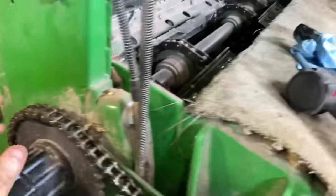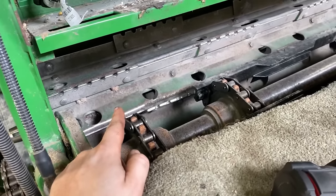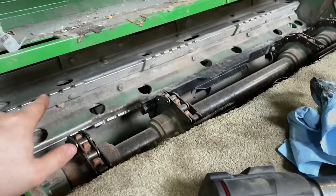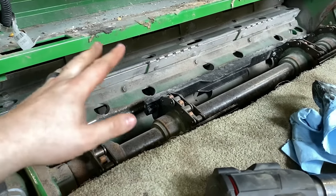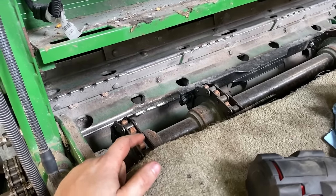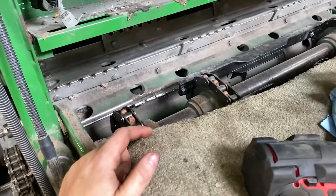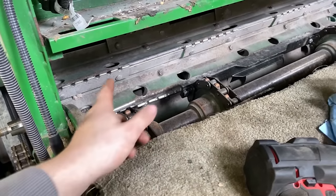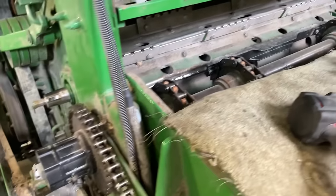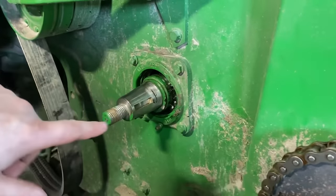And then you've got a whole feed accelerator full of bean dust that can catch on fire. So you almost got to take some of the supports off and then try to get it cleaned out, or you dose it down with a bunch of water, whatever. And then when you take those supports out, then that thing's unbalanced and it wants to always move. And you know, I might end up having to take those off, I'm not sure yet, but I'm tired of torching these and, you know, creating a fire inside or getting this shaft too hot.